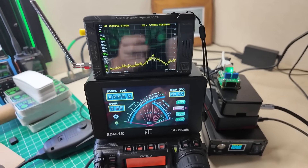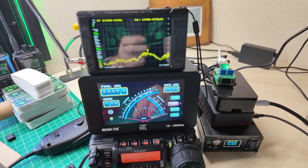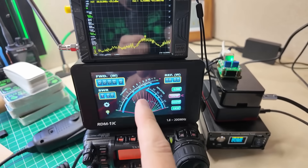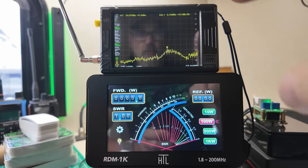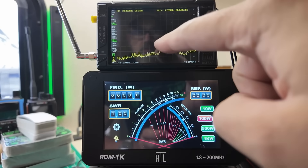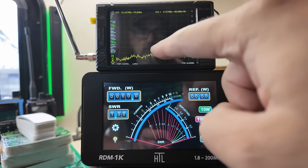The last time I brought a new meter in, you guys thought it was RF noisy and blamed the meter, but I really think it was the USB power supply. I didn't get a USB power supply and I could not find any noise on it. Let's take a look on the TinySA and see what it says about noise — right now we've got a whole bunch of stuff going on including the meter itself, a little hump there at minus 30, sweeping from 3 to 30 megahertz.